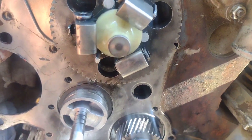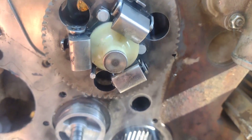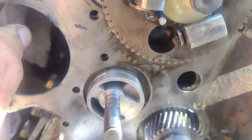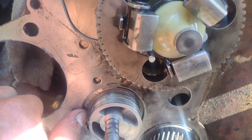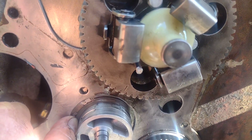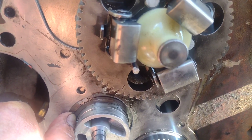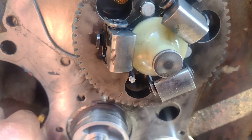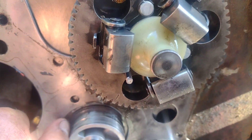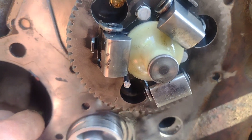Here's what I just found out. Look at how you put the cover on — see how there's an ear here and an ear here on this metal plate? Well, back there's a circlip. See that circlip? It turns, and it has to be indexed. I don't know why they did this, but when I took it apart it was over here, out of position.